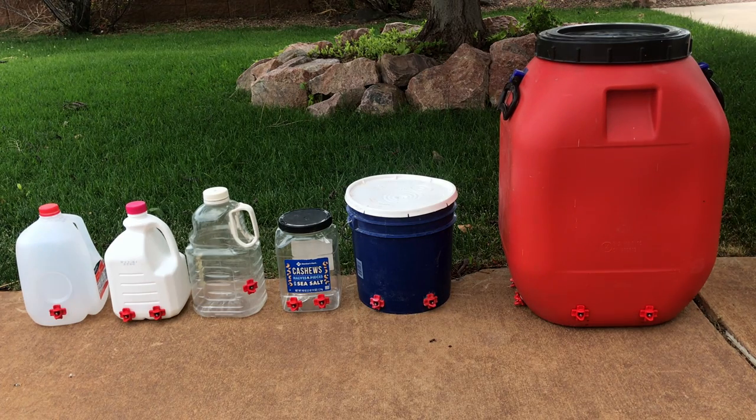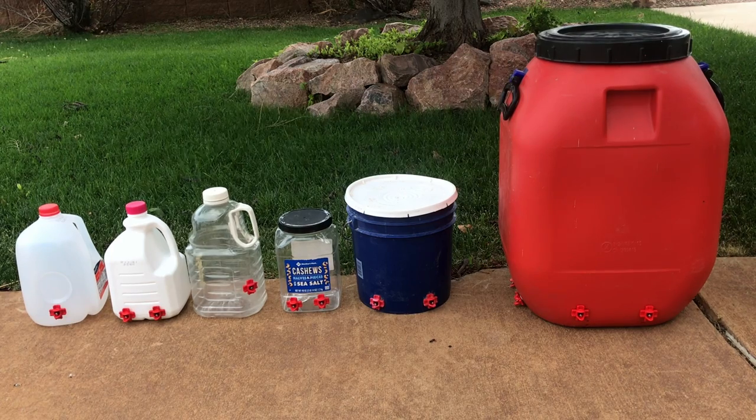Also, these nipples don't store mold or any gunk inside of them, and because they don't store water, they don't freeze. Unlike the vertical nipples, that's a huge advantage. The vertical nipples and the cups both hold water inside, so come the wintertime months when things get cold, they'll freeze, crack, break, leak, cause all kinds of issues.